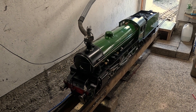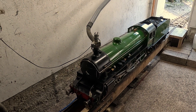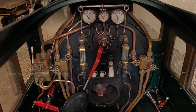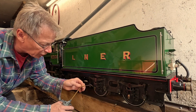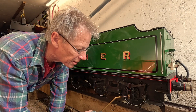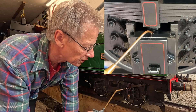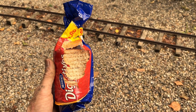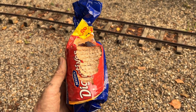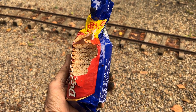Having done all the repairs on the axle box on the tender, it's time to steam up and check that the engine's running properly before visitors tomorrow. Small fan lifting the fire, fire lit, water in the boiler, no pressure yet. From now onwards I'm going to make a point of putting a little drop of oil directly down into the holes, straight down into the axle box, straight down into that bearing. Here's an interesting railway lesson learnt: it's obviously very important to finish a packet of biscuits once you've started them — we had eaten some on the railway one afternoon, and a small furry animal has helped itself to what was left. Always finish a pack of biscuits.